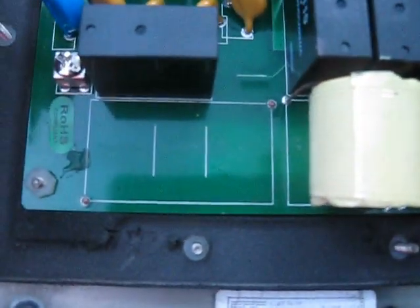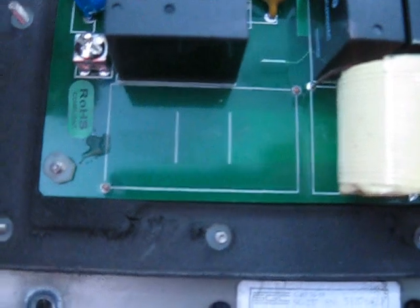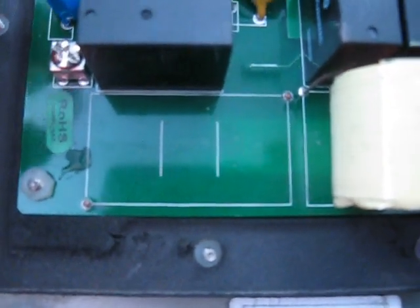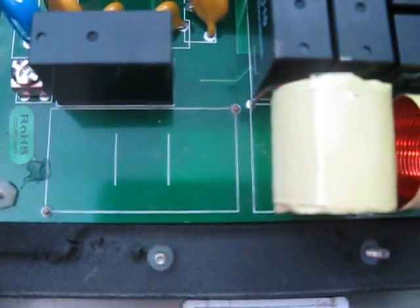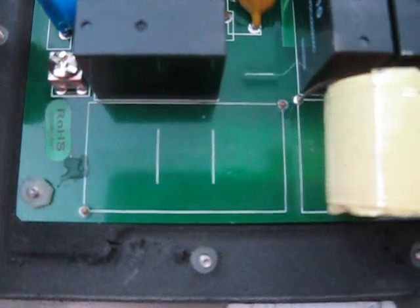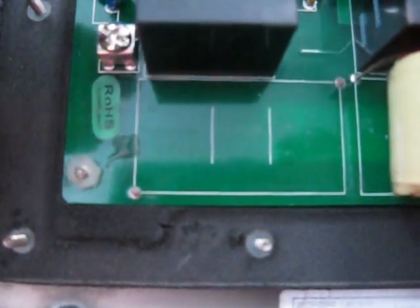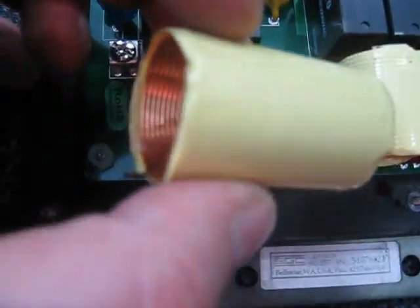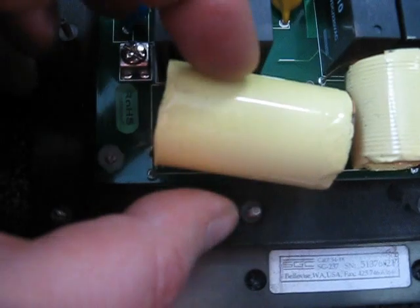I thought I can fix that, and I looked a little bit closer. It's really not bonded to the circuit board. None of the bigger components which are loose are bonded physically to stop them from vibrating. You will see little tiny pieces of silicone sealant there, and a matching piece here, but that wasn't a proper bond — it just went across.